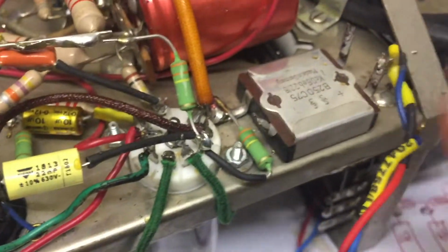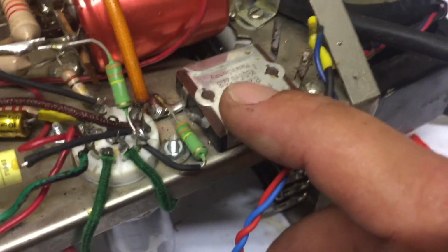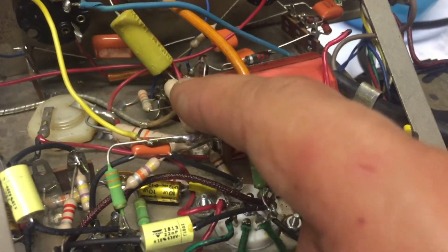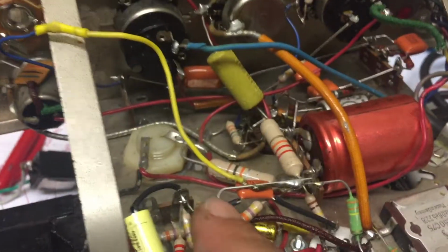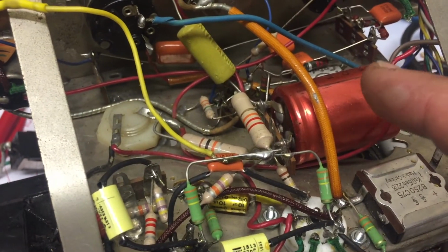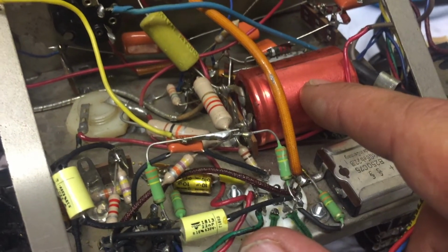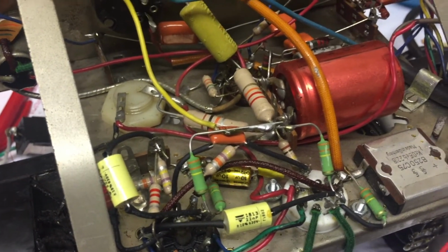The AC came here to this selenium rectifier. We're going to remove this, put this signal wire to the floor, remove these big resistors. They are part of the power rail, and we replaced them on the other side. Disconnect that old filter cap, and that will make a difference, because I don't understand why I think they changed this one. There used to be a big filter can right here, so they replaced 2 of the capacitors and they left 2 others in circuit, probably because they didn't have any room left.